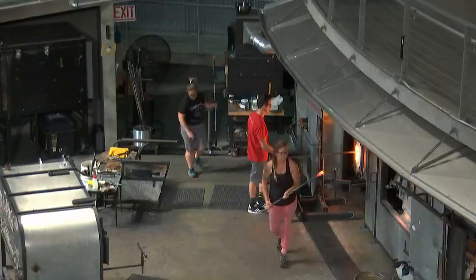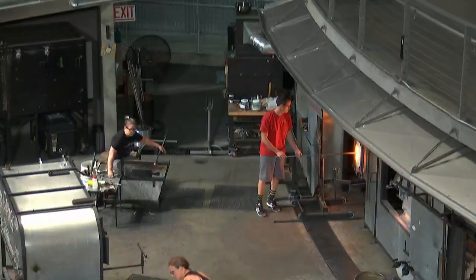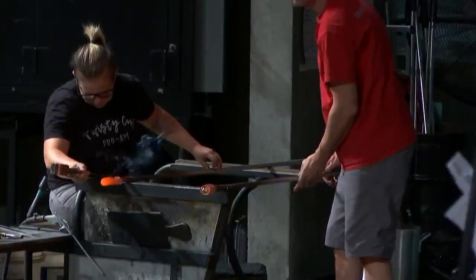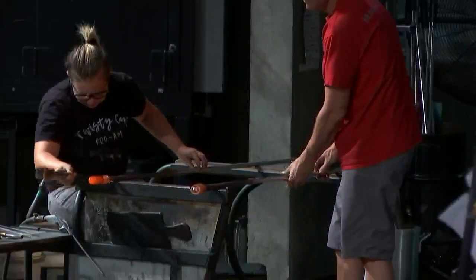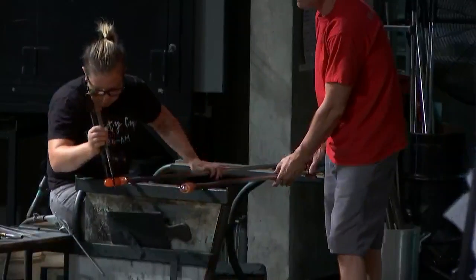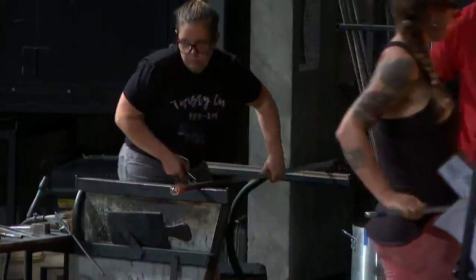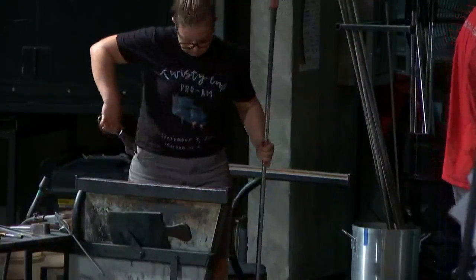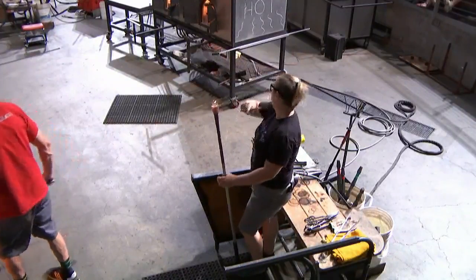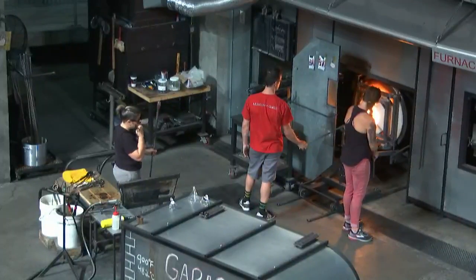When we want to get it out, we take one of those steel pipes, and we dip it into the molten glass like you dip one of these into a jar of honey. We dip it in, twirl it around. A little bit of the molten glass sticks to the end of the pipe. The pipe itself is hollow, so when we blow, the ball of glass blows up like a little balloon. If we want to make something larger, we dip it in, blow a little bubble, let it harden, and then we dip it in a second time, or a third time, or a fourth time. We just keep coating it with molten glass.